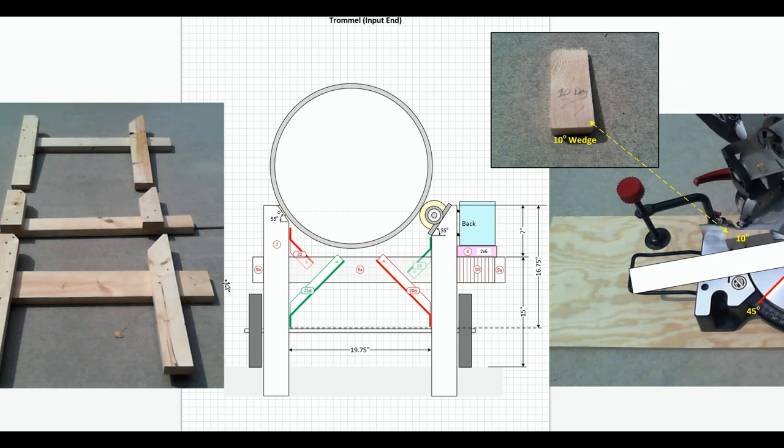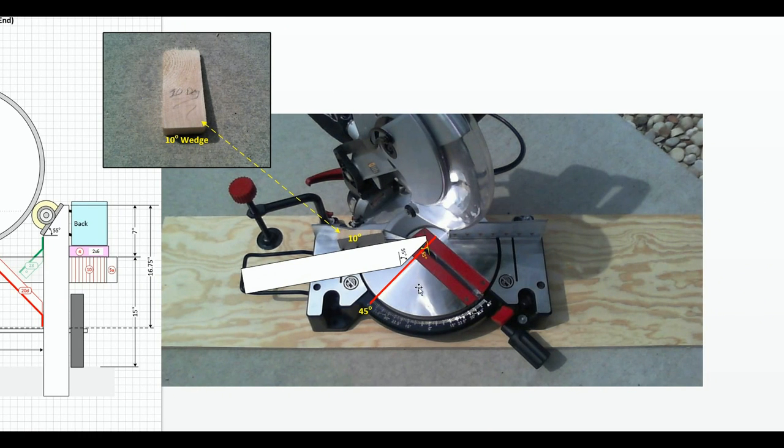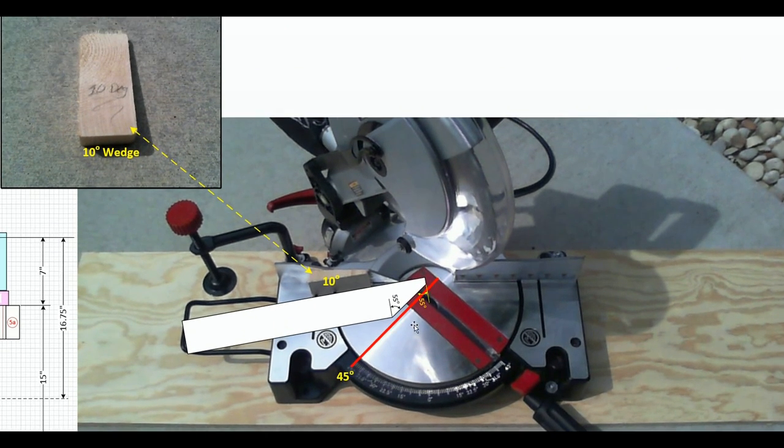To show you how we made those cuts: the miter saw is only able to cut a 45-degree angle from center. To get the extra 10 degrees, we would first make a 10-degree wedge by setting your table saw to 10 degrees and placing your 2x4 in there. One thing you've got to be mindful of is when you place the wedge on the miter saw, you have to make certain that your 2x4 is not going to be hitting the side of the miter saw. So you may need to move the wedge in closer to the blade. Once you set your miter saw to 45 degrees plus the 10-degree wedge, that will give you your 55-degree angle cut.